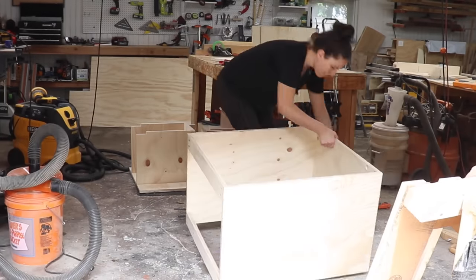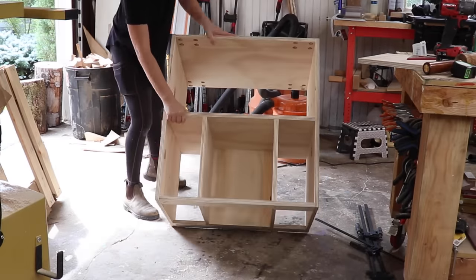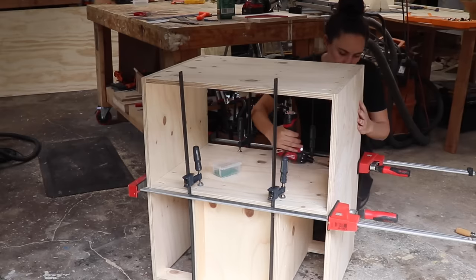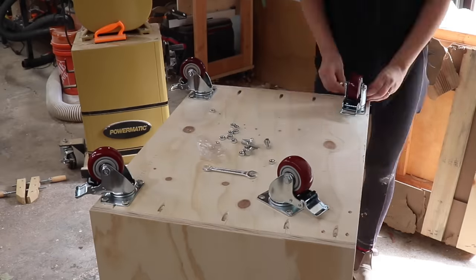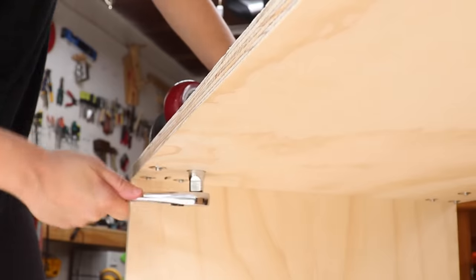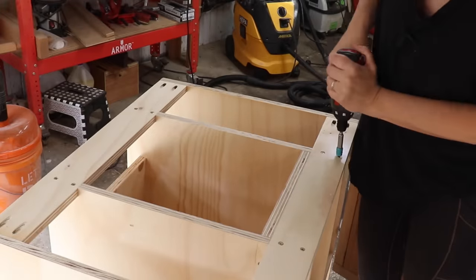To get the center compartment in place, I flipped the whole cabinet upside down and put the center compartment in so the notches fit right into those three-inch stretchers. I got some clamps on there making sure the center compartment was pulled up tight against the stretchers and then screwed the center divider into the cabinet from the underside using pocket hole screws. While it was upside down I installed the casters, making sure the countersunk holes were big enough for my socket wrench to tighten them. Then I secured the stretchers to the cutouts on the center compartment by pre-drilling countersunk holes and locking into place with screws.